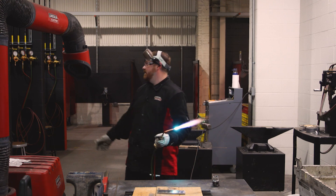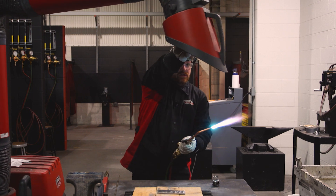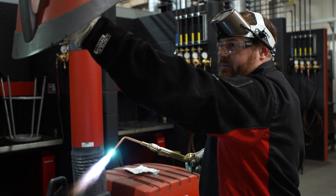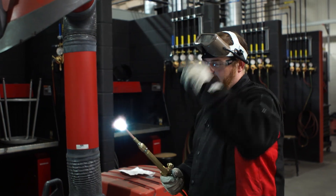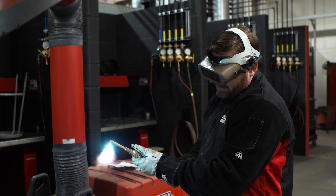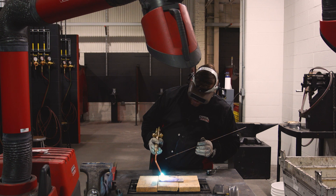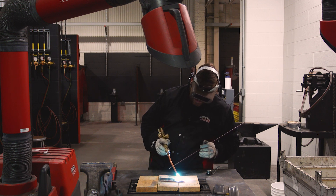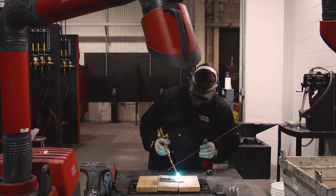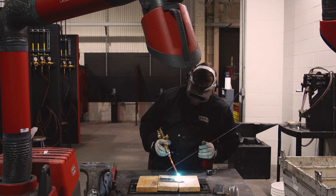The reason I dropped my goggles is so I could actually see the flame clearly, because right now it's very bright. I'm going to be very careful observing my environment around me while I grab my fume hood to weld with — now I have proper fume extraction. Now I'm ready to weld. I'll draw my goggles down, double-check my flame size, hold the torch, and heat the piece up before I actually start welding because it needs to be warm.